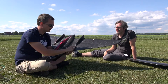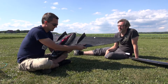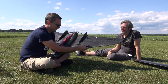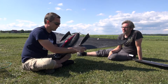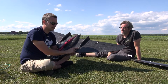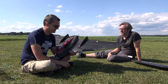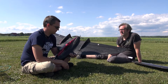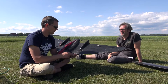The reason I like O-rings is because they provide a physical stop, but it's still a flexible mount. In flight nothing will happen, but if you land hard, the forces are absorbed by the O-ring — that's why I like it. I've also designed 3D printed joints that do the exact same thing as these nylon screws, and they're on Shapeways. You can also download them and print them yourself — they're free.